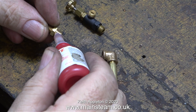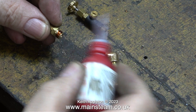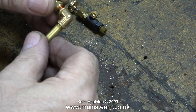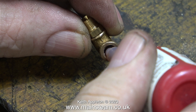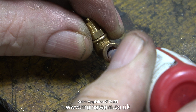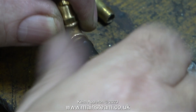What I intend to do is fit one of these double steam unions to each of the elbows. I'm applying some Loctite 542 thread sealant to the threads before assembling them. I could have just made some quarter by forty inserts, but I prefer to use the double unions with the hexagon part on. I'm now applying some Loctite 542 to the other end — you really don't need very much. Now I'm screwing the steam tap into the other end of the elbow.